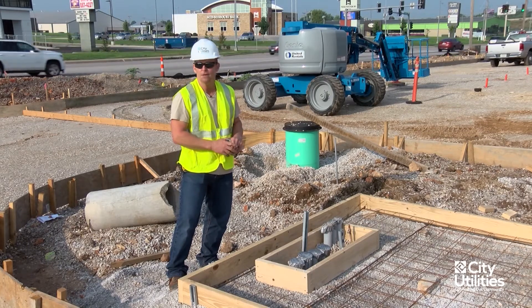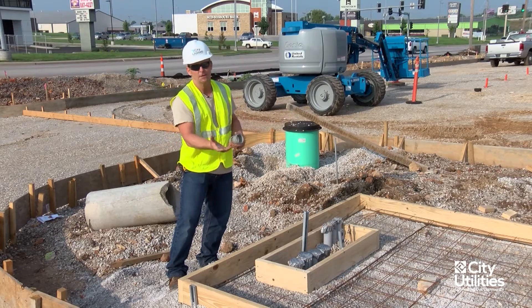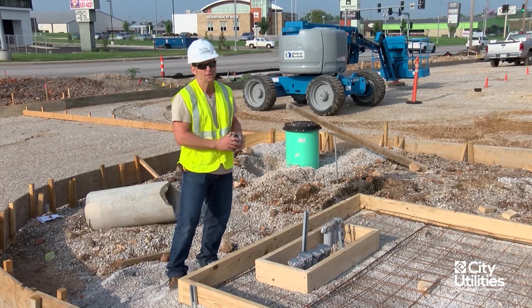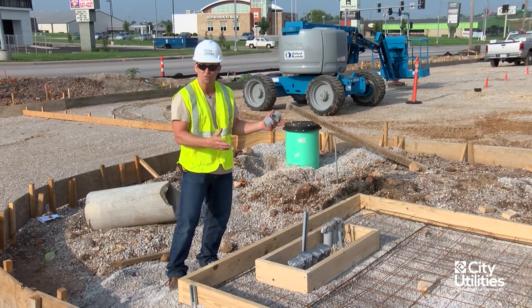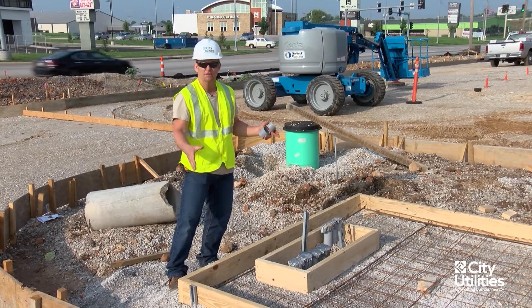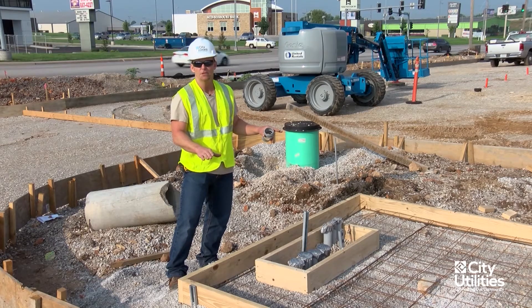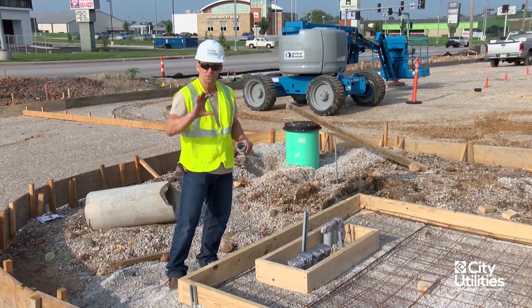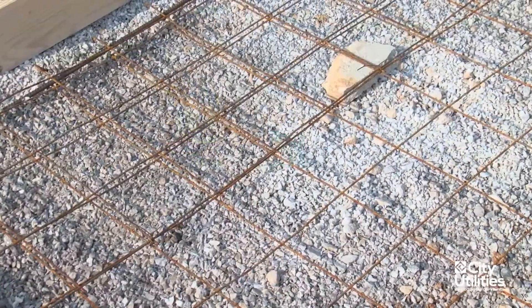This particular area is going to have a 300 kVA transformer, primary being on the left, secondary being on the right. That is always the way things are — it's non-negotiable; that's the way the manufacturer makes the transformers. On this particular area, we always have a six-inch lift above finished grade, so once everything is completed, this transformer will be six inches above finished grade. So let's go through some of the standards now.